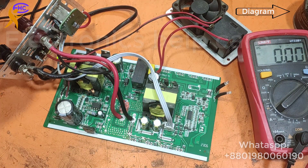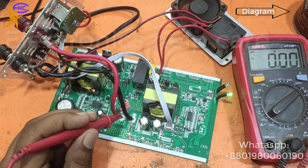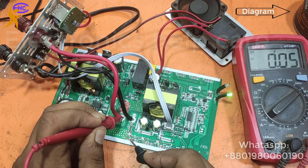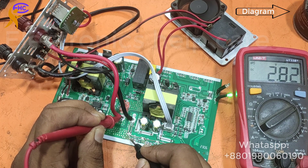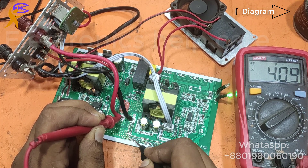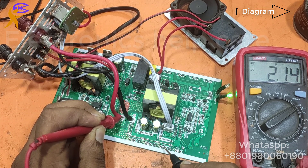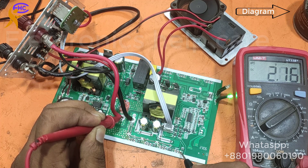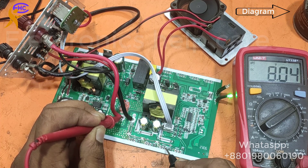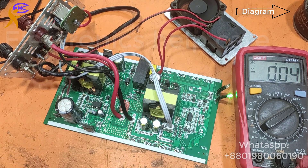I already connected with the battery. I am switching on now. I want to check — this is the positive and this is negative. 13V for the source. Source voltage is 13V, okay. And the gate will be half — 7 or 8. Source 13V, gate 7-8. Source will be full voltage 13V and gate will be half, 7 or 8. That means the circuit is working. This input section is okay — the gate voltage is half, that means this input section is okay.